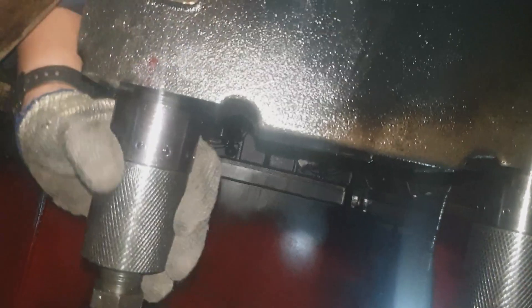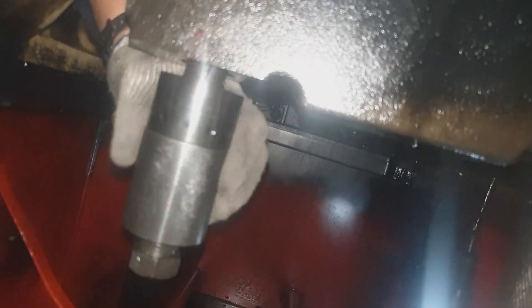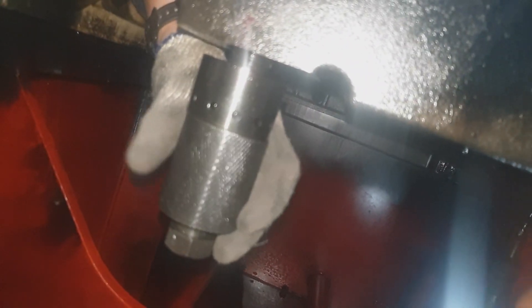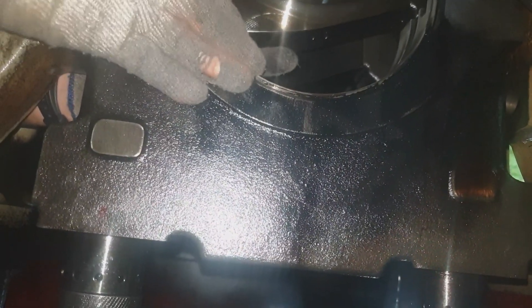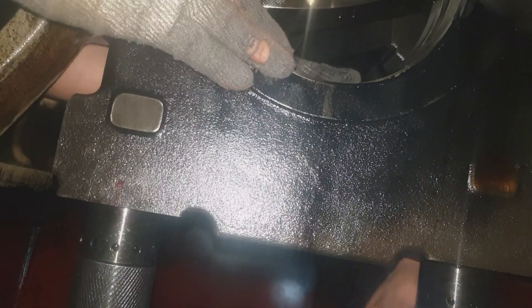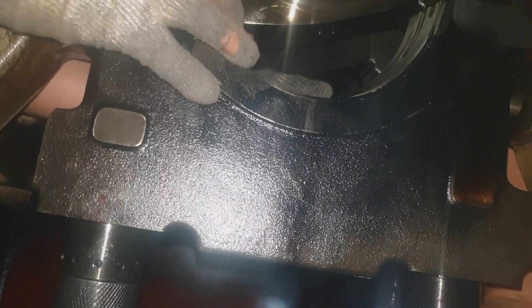As I said before, when you replace the bearing you have to replace it in pair — don't just replace one of them, because that is the recommendation of every maker to avoid any complications. In this video I haven't shown the full disassembly procedure; maybe for the next video I will upload one of the procedures. As you can see, that's the main bearing — the lower part.